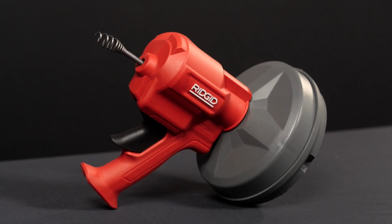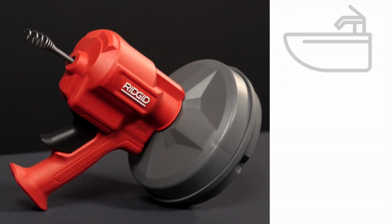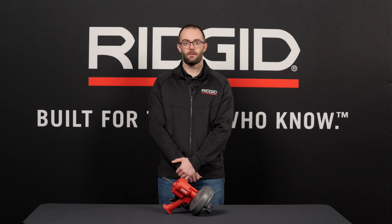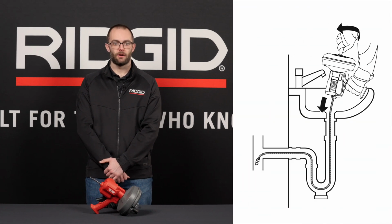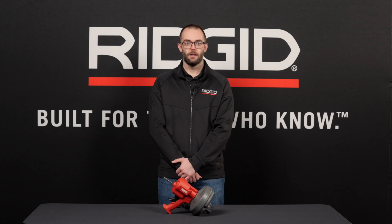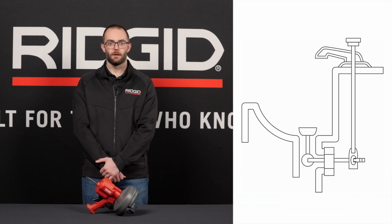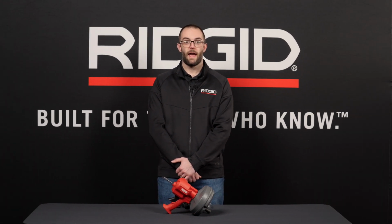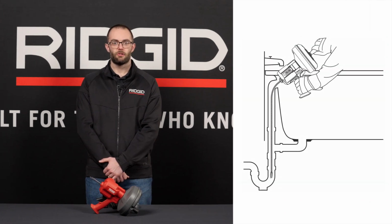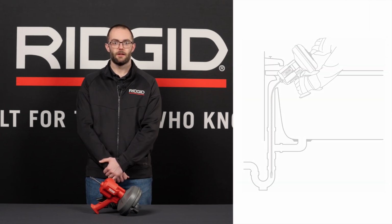The Easy Spin is a handheld drain cleaner, ideal for sinks, tubs, and showers, and 3/4 inch to 2 inch drain lines. When accessing a sink drain, you can feed the cable through the drain or by removing the P-trap. If accessing a sink with a pop-up drain, you should remove the lift rod and drain plug before feeding the cable. When accessing a tub drain, you should feed the cable through the bathtub overflow. Be sure to remove the overflow plate and any internal mechanism.